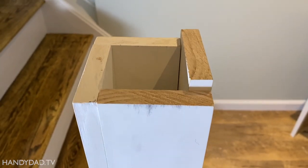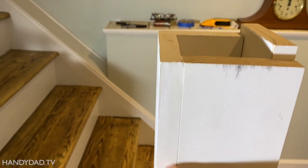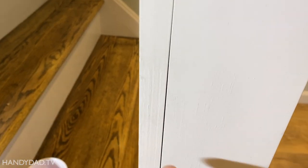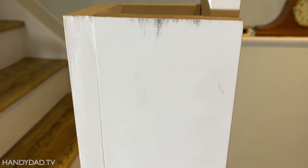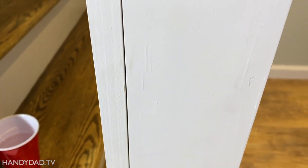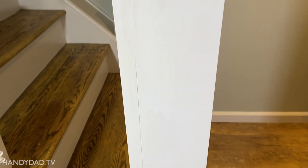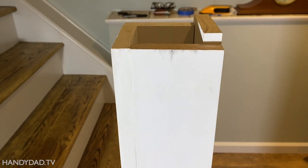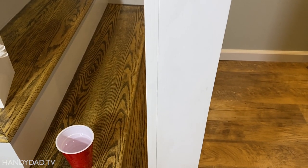The spacer blocks were sized to allow the wood to cover the old-fashioned railing by five-eighths of an inch. The only downside to hollow posts is that you've got four pieces of wood joined together, and there are definitely gaps that need to be filled with caulk and nail holes that need to be filled with spackle — so that's a before picture. And this is after. You could still tell it's made with separate boards, but once it's painted and the railing's all here, nobody's going to care.